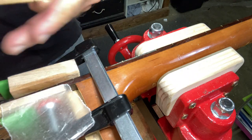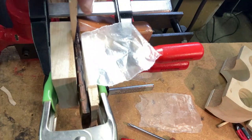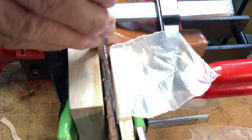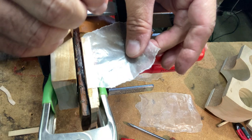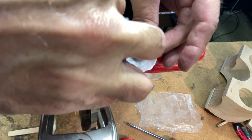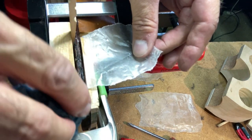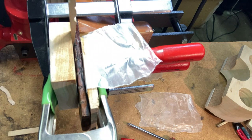Let's take a clothespin and kind of shave it down a little bit. There — you can see some glue squeezing out there now. You can see when I put that wedge in there, glue's squeezing out. So that means it's putting some pressure right in that spot, that key area. Let's clean it up a little bit; I can do some more cleanup after this is dry. This side has good pressure all the way around.